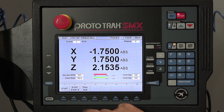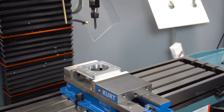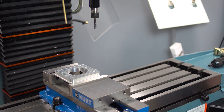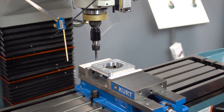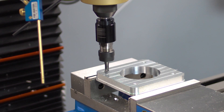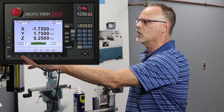I'm going to hit the mode key, go to run, and say I want to start at event 11. It says when you're ready push go, so I'm going to push go. Here I am in the home position — it's telling me to make sure I got the right tool in there and turn the spindle on. I like to use tracking to make sure it's in the right place, but remember: there's a point where it has to take over in order to cut the thread at the right pitch. I'm going to track the first one and then let it do the rest by itself. I always like to start a little above the top of the part just to make sure my numbers look good — and they do. Once it finishes it goes back to forward, and since it's still in tracking I'm going to hit stop, CNC run, and go.